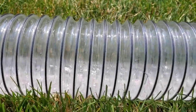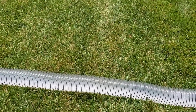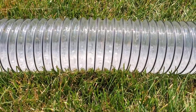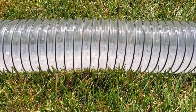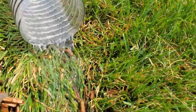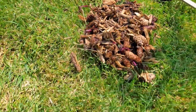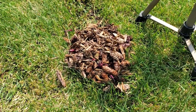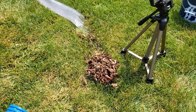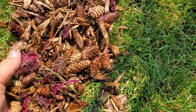We're going to do more with this clear four-inch corrugated pipe to teach you more. Younger contractors need to know this — 33 years I've had to put up with all these myths about how single wall corrugated pipe has issues and collects debris. It literally got this bad reputation because of bad installers and DIYers. This is a user-friendly drain tile. It's so flexible you can go around AC units and all types of obstacles in your landscape.